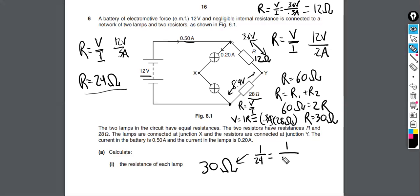So it's like I'm adding R1, well, let me put it like this. What is the combined resistance just of this? If this is R1 and this is the same R1, then the total resistance across here would be R1 plus R1, or 2R1. The way I need to add it though, with the resistance of these guys, is the reciprocals. So it's 1 over 2R1 plus the same thing for this one.